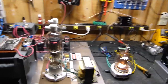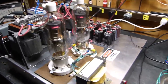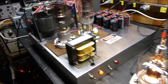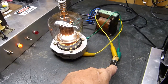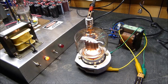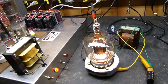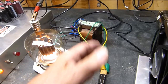What I have set up here is a huge power supply with 872 rectifiers. I'm going to put a positive grid voltage on the tube so it can conduct at a much lower voltage — I've put 9 volts onto the grid and the screens, because they're all strapped together in a zero-bias triode-type connection. That's why you run these tetrodes as a zero-bias triode, strapping the grids and screens together. I've got a fan on it putting a nice breeze across it.